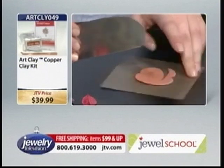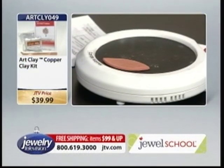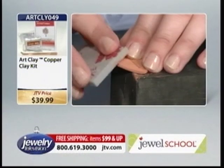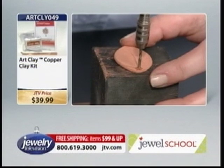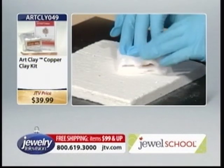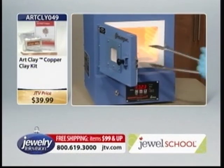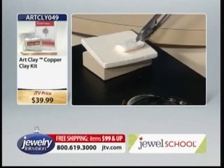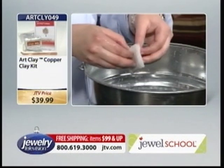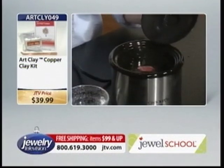But then once you've got a batch made, you're going to keep using the same batch for quite some time. When you're not using it, you turn off your heating device. If you're using a glass vessel on the stove, the old-fashioned glass pots and pans you can still get, that would be great. Or I use a little mini crock pot. You don't want to use a metal pan on the stove, though, because metals and pickle are kind of picky together. One metal at a time, and copper's our baby right now. So use a glass pan on the stove or a crock pot, which is what I use. And then you can just turn it off and let it come to room temperature between uses.